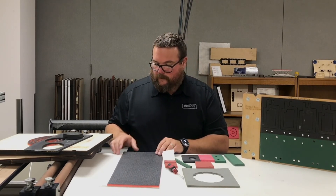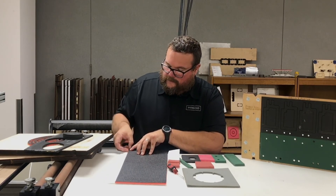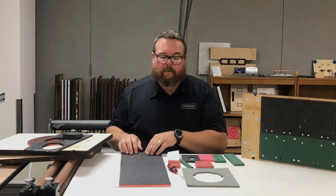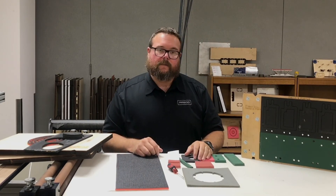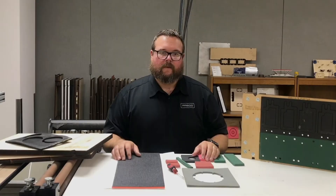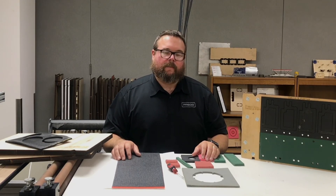They've even got some new rubbers that are out now. This one has an anti-static coating on it, and it works really great. One of the hurdles with ejection rubbers is that the action of the rubber touching the material can generate a static charge, and if you've got a really free-cut slug, sometimes those slugs will want to stick to that rubber. This anti-static rubber will help mitigate that. So there you have it — there's really not that many mysteries to ejection rubber, but it really can help you solve some real-world problems just by altering how you use it.